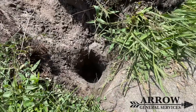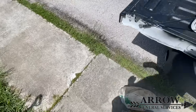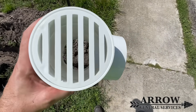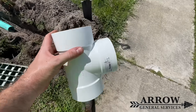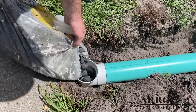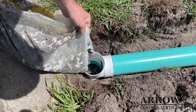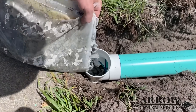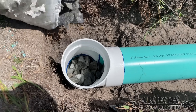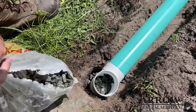At the end of our run, because we don't have any slope in the yard and there's no good way to daylight the pipe at the end of the sidewalk, we're still going to make sure our line is sloped in the ground. Once we get to the end, we're going to dig two feet down, use a clean-out tee, put a grate on top, and put a two-foot piece of pipe on the bottom inserted down into that two-foot hole. Then we'll use large drain rock — the kind we use for french drains — dumped down into that two-foot pipe. Your water will make its way all the way to the end, percolate down into the ground, and once the ground starts to become saturated, the rest of the water will come up through the grate and flow to the road.